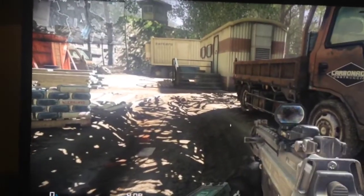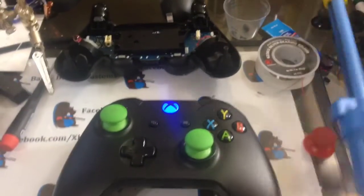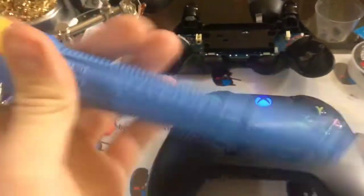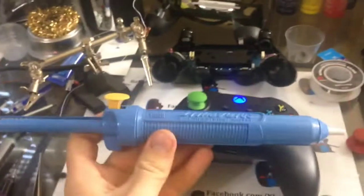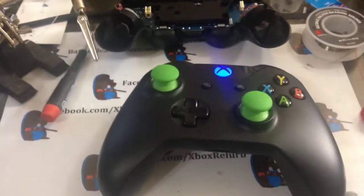So we're going to switch this one out. We're back, and we're going to go ahead and replace this right here. Tools you need: a soldering iron with a good tip on there. I like to have some sort of a solder sucker — I like this big solder puller. Pretty awesome. I'm going to get this torn down.